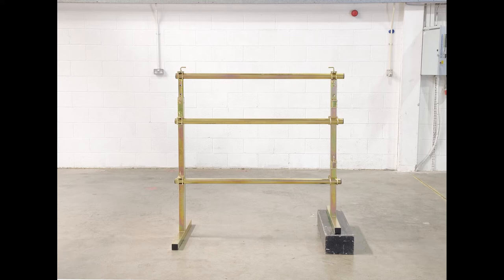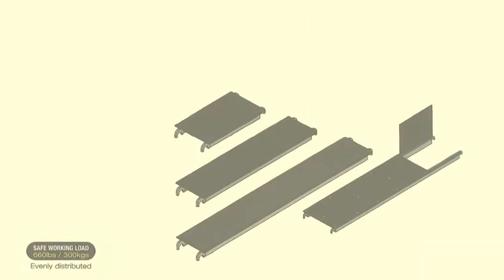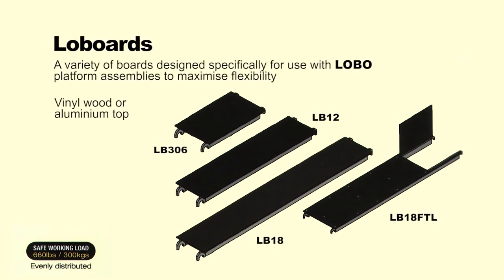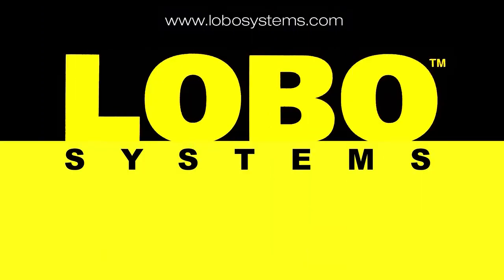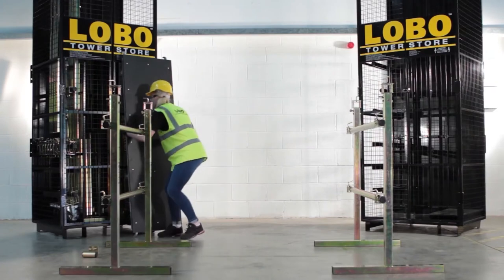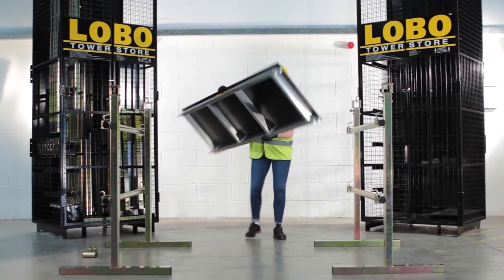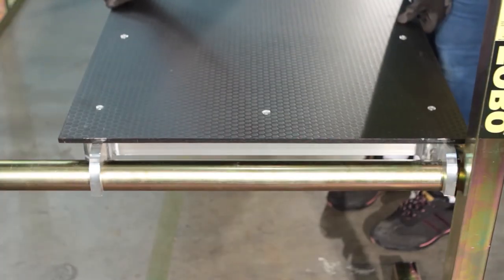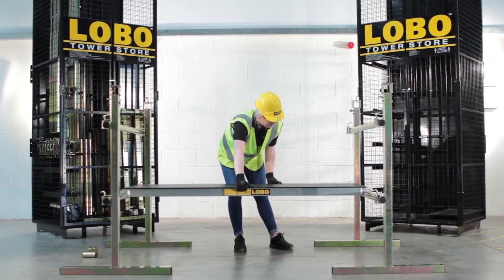In this case, only the tube at the top is load bearing as it sits inside the top clamp. Lobo system low boards are all rated at 300 kilograms safe working load uniformly distributed, and they come in a variety of lengths, widths, and top surfaces. A hatchway door option is also available. Here we repeat the initial assembly process and use more trestle legs to produce a second trestle configuration.